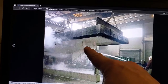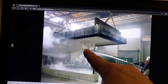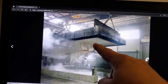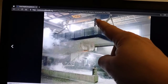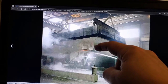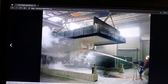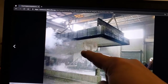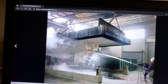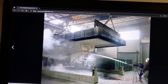You have, in this case, a cable tray, and it's got fireproofing placed on the outside. It extends 3 feet on the unexposed side. Why? Because that's the fire stop portion of the test. We always have the penetrant sticking out 3 feet on the unexposed side. But then it goes down further and horizontal, and then does 1, 2, 3, 4 changes in direction.